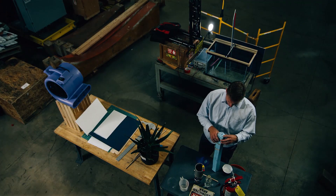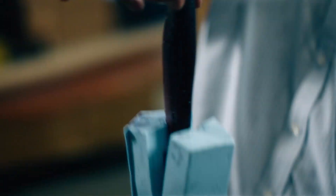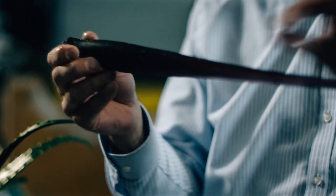That's a clear indication that we have achieved load reduction. Let's come back to our candy blade — it should be cool and hard by now. There we go, it's ready. This is our ATB blade. It's a little difficult to see, but compared to a traditional blade, there's a little bit of curvature. That curvature is a design intent allowing us, when this thing gets loaded, to twist and flex, just like our aloe plant. It's this curvature that gives us — just like we saw in our experiment — the ability to twist when loaded up. It's that load reduction that allows us larger rotors.